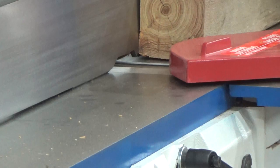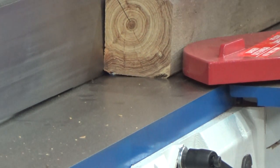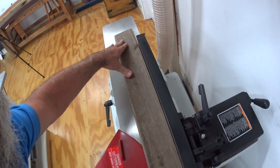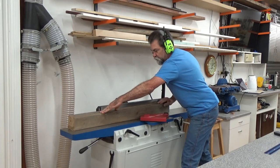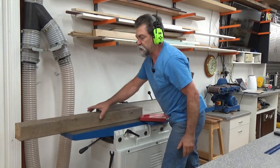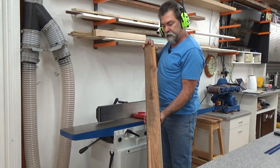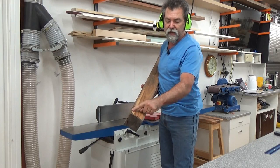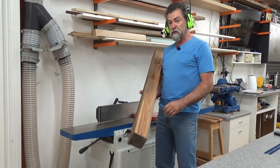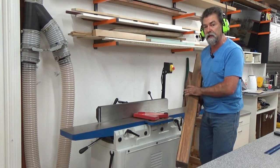Remember, half the rock. I'm going to use the fence as a guide and hold it halfway. Now I can push down on that side. As we're coming along, it's going to slowly transfer the twist — the blades will be cutting on the other side. Nothing at this end and most of it on that end, it's missing a little bit here. I'm transferring the cut from this side to that side. Works really well. Now when I put it through, I don't have to compensate at all — I have reference points that are already cut into the board.